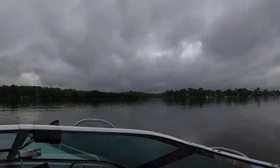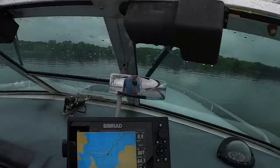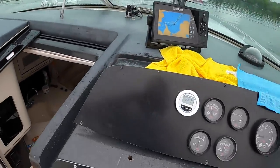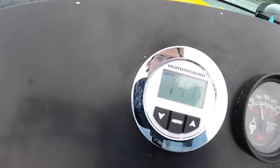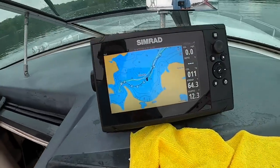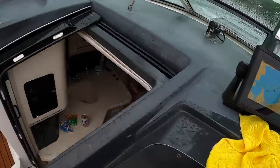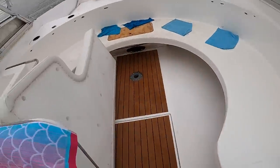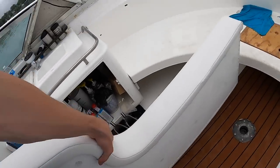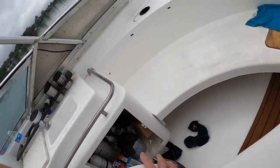Still floating all right? Yeah, my depth isn't reading. Probably got some growth on it. Been in for a couple weeks. That's okay. I got a redundancy depth finder here. So there's one through the hull, and then I got one sticking off the back of the boat. It is reading temperature, so that's strange that the depth isn't feeding back. But this is a temporary cushion that I've been using in the meantime.